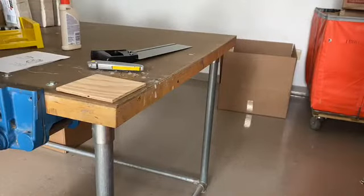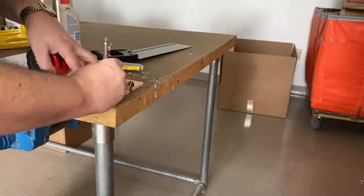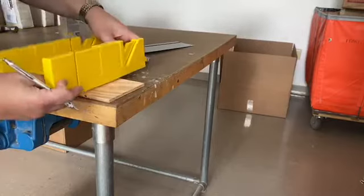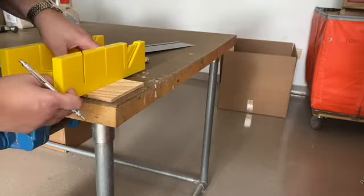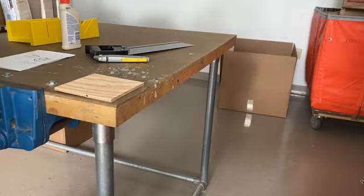I'll take my piece of wood and a tape measure and a pencil and make some marks first. I'm going to use those marks as a way of figuring out where I can put a line — I can use the miter box as a ruler here and follow my lines. If you have a square, you could also use that; it's probably not a bad idea if you have one, but this will definitely work. So I have a reference mark and then I'm going to start to saw.